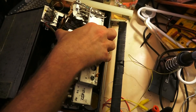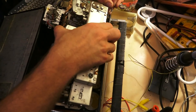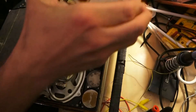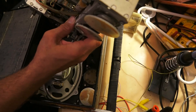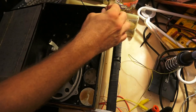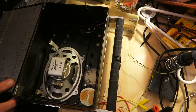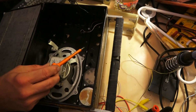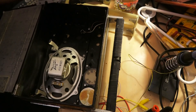We need to find out where the AM antenna is — it's obviously designed to come off. Setting our speaker aside, the antenna bar must be in the handle because these wires go up into the handle in the vicinity of the tuner. There's some kind of little wire piece that's meant to touch the chassis — an RF ground point or something.